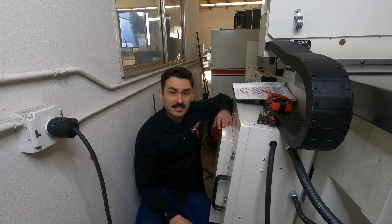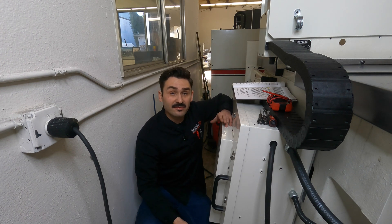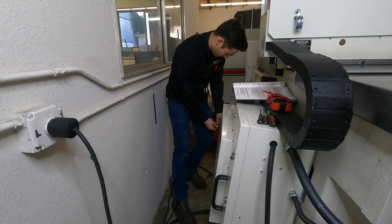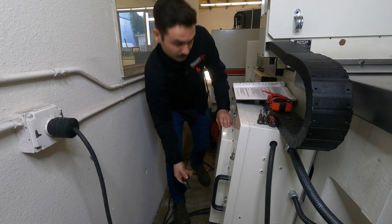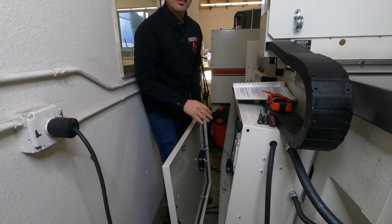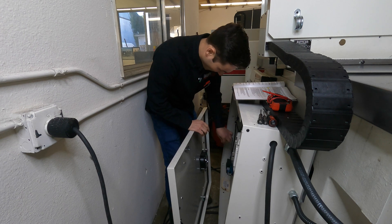Here at the back of the machine we can open up the electrical cabinet and begin wiring. We'll need our electronic cabinet key, which is usually attached to the front of the machine — a second one is found inside the pizza box. When we remove the electrical enclosure cabinet, there will be a wire attached to the fan, so disconnect that before moving it entirely.